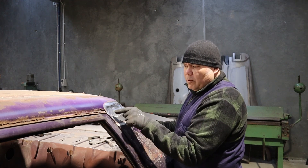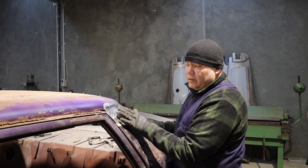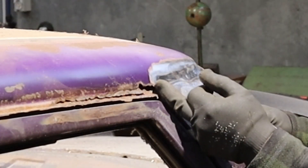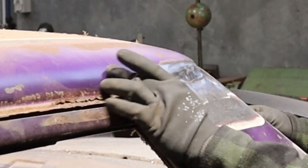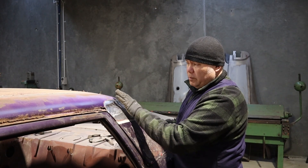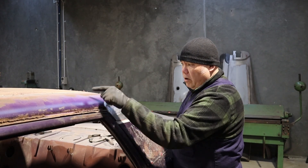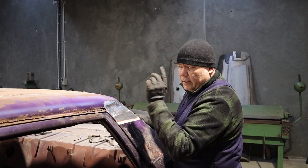Part of my assessment with where I was going to put metal in this car was that I didn't want to touch that lead join — it was sound and I wanted to leave it alone. But because the rust comes right up to it, plus there's rust there, you think: if I put in a piece there and a piece there, how do I know it's not about to rust there too? I'm not going to take that gamble. I'm just going to replace the whole piece because there's so much going on, and then we don't have to worry about it rusting at a later date.